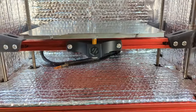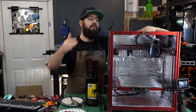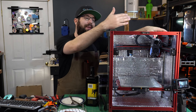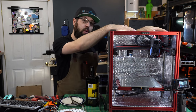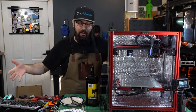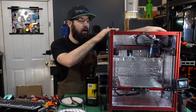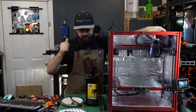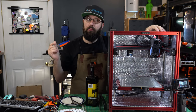So what is Toasty Boy? Toasty Boy is a Voron V1.5 that I've slightly modified for higher temperature printing. This is not a high-temp machine - there's no secondary heaters in the chamber - but it does have a high quality bed with a heater mat adhered with high temperature RTV sealant. I can run the bed up to 120 Celsius. The entire machine is insulated, which lets me print PEKK on it, and it does a pretty okay job.